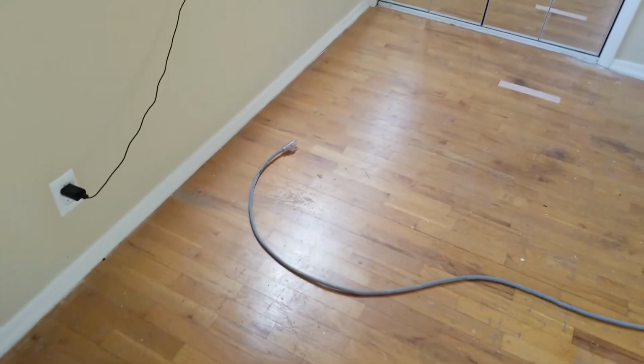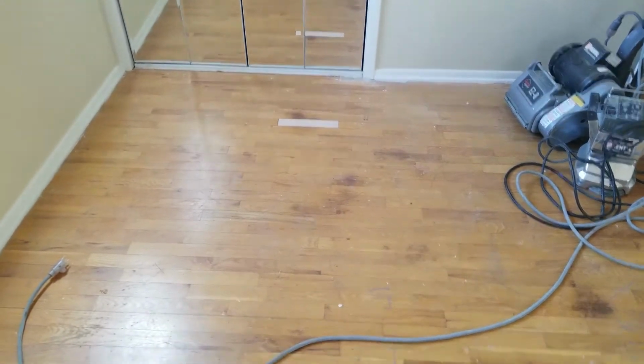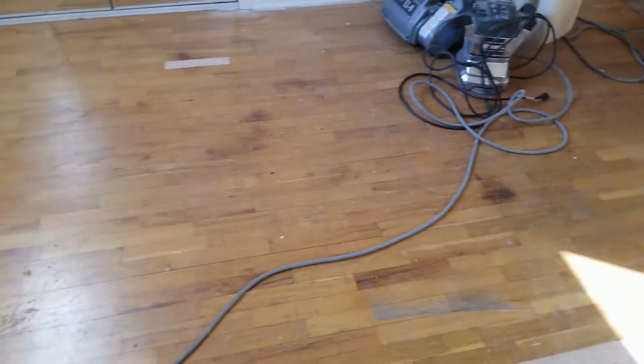Also, I was able to start on 24 grit, no problems. I didn't have any issues with it eating too fast or faster than I could handle. I still had to go very slowly when I was going both diagonally and with the grain, so I had no issues there. I wouldn't worry about it too much versus a 36 grit. 36 grit would definitely take longer though.